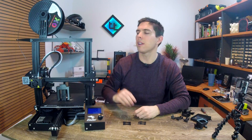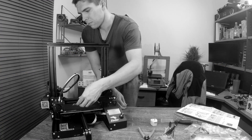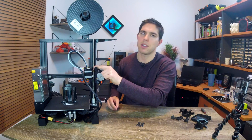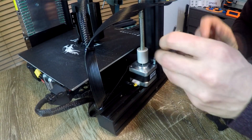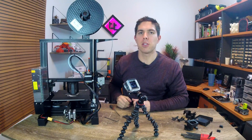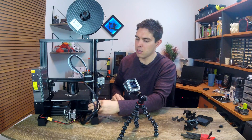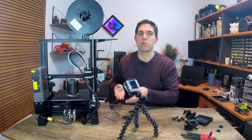In my initial review, unless I loosened a couple of screws for the z-axis I had some binding. The solution of loosening them works but it's not ideal. I found these shims on Thingiverse and they claim to offset the z-axis extruder just enough to align everything so you can have the screws nice and tight. As far as I can tell we only need to remove two black countersunk hex bolts. The part with the cutouts sits vertically against the extrusion; the other sits underneath the stepper motor. A tip: you can wind the lead screw by hand to lift the extruder up and down to get clearance.